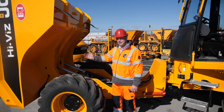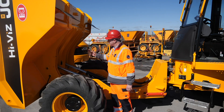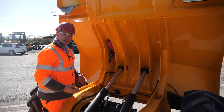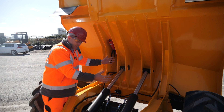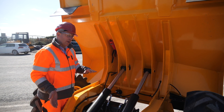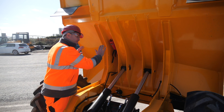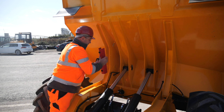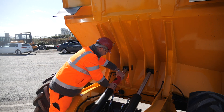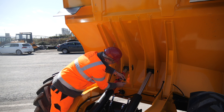A very important safety feature on the forward tipping dumper is the body prop, also called a safety strut. When the skip is tipped forward it passes its centre of gravity and pushes away from the dumper. To demonstrate: open the two safety latches and secure the strut in place. There is also a small strap that needs to be fixed to ensure it is correctly positioned.